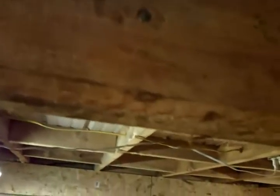It's two 12-foot 2x4s, sawmill cut, rough pine lumber, nailed together with 20 penny nails through the side and through that side. There are probably about 50 or 60 nails in it. I nailed a 2x4 up against this solid oak 4x4. Driving nails into that oak is a pain. Then I set this beam up on top of that 2x4.